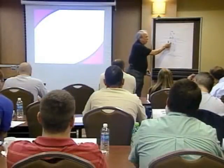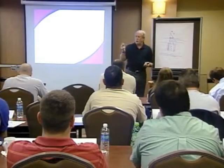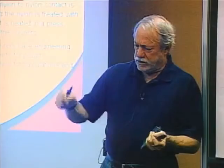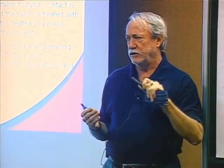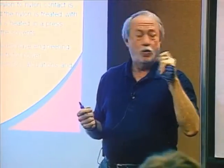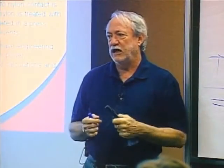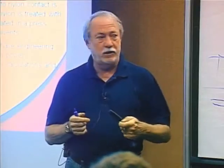The amount of catalyst that it takes, you would take an acid brush and cut it down so it was very stiff, and you would dip it, shake it off, dab it on the skive area, and then take a putty knife and scrape that off. I mean, it takes so very, very little to get a good splice. When you're analyzing failures on nylon core, most people use way too much adhesives when they do those splices, and they don't get a good bond.